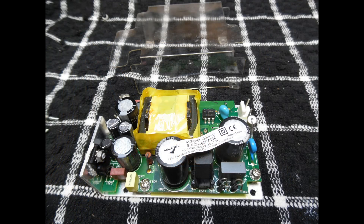What I'm showing here is the switch mode power supply for the unit — it's been removed. To the rear there's a transparent cover, just a protection cover because of the high voltages associated with switch mode power supplies. The two bigger electrolytic capacitors are rated at about 350 to 400 volts, 47 microfarads. This power supply provides two output voltages: normally 25 volts for the main power amplifier stage, and also a 5 volt supply for the microcontroller and other associated circuits.